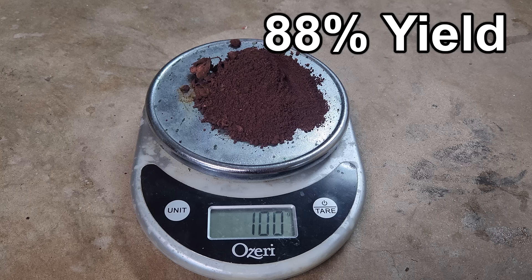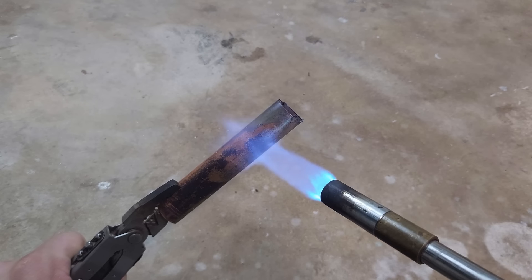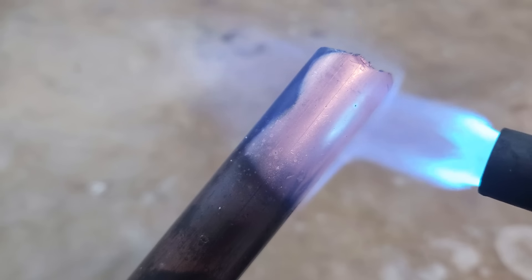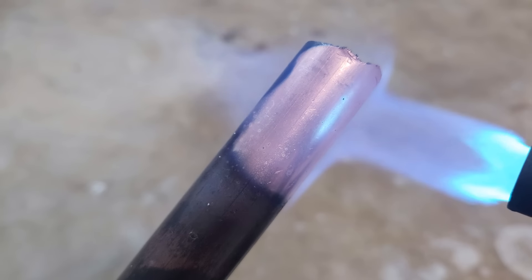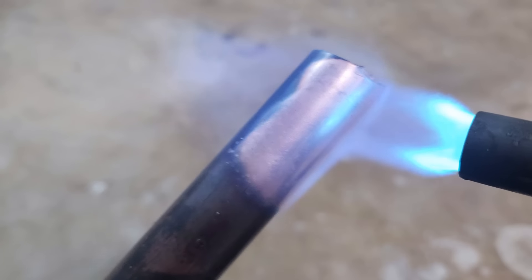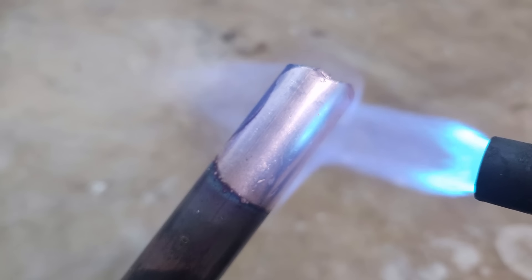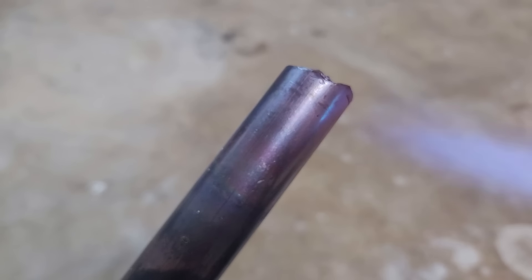You may notice that the copper powder is quite a bit darker than a typical chunk of copper, and I think that's because a lot of it oxidized during the process of drying. Now in theory, when I melt this down, the oxide should burn off. Copper oxide is peculiar in that with enough heat it will actually decompose back into pure copper metal and oxygen. You can see this pretty clearly on a piece of copper pipe — when I heat it a little bit, initially it turns black from oxidation, but when I put the flame directly on it, the heat breaks down the oxide layer and makes a shiny clean area of pure copper metal. So in theory the same thing should happen when I go to melt down my oxidized copper dust.